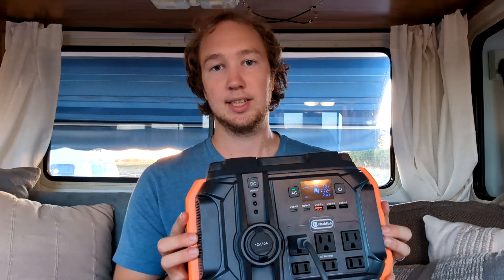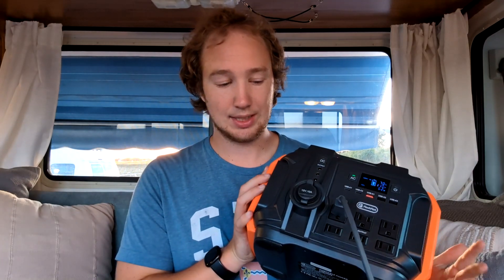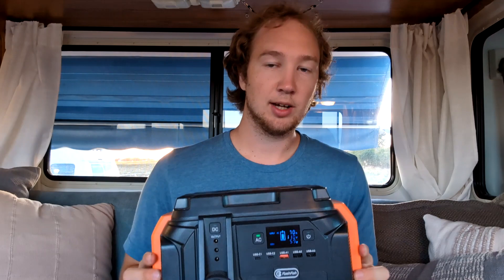The next question is how much does this power bank realistically actually produce, and is it worth it to purchase to power Starlink as well as other electronics like phone and computer? From my research, the only stat that really matters is the watt hours. The amperage isn't that important as long as you're not trying to run a space heater, computer, Starlink, and something else all at the same time. This can run all of that individually, and we honestly never really need to power more than just one thing at a time with it. This power bank comes with 540 watt hours. A quick and easy watt hour calculation: however much wattage something uses, that is how much it uses per hour. So if it uses 70 watts and you run it for a full hour, it would use 70 watt hours. That's a pretty accurate rough estimate, and it honestly is accurate with how much wattage we use.